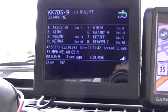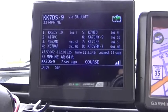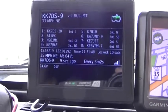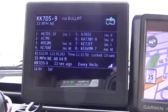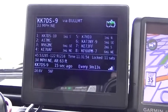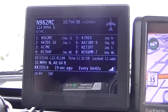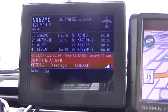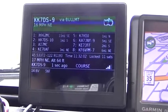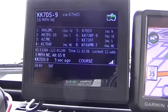The flashing in the background of the color bars is due to the fact that I'm using a very low quality AV cable to connect the BeagleBoard in the back of the car to the screen up front. There's a lot of alternator noise — it doesn't do that at all when the engine is not running. Improving that cable should make it go away. We've come to a stop here.